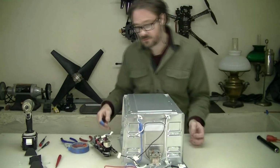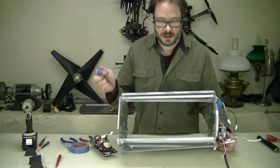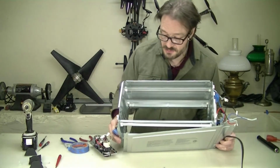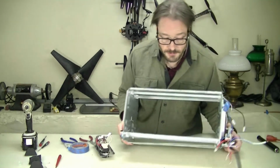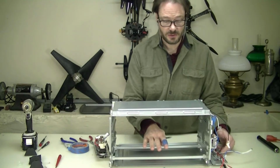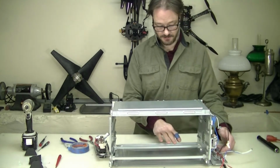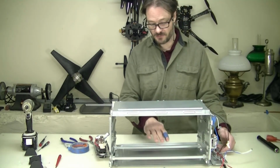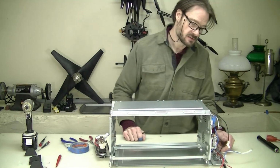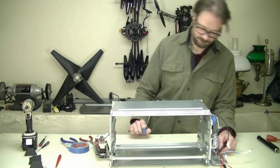And for that reason, I think I'm going to disconnect these top 2 heating elements. Maybe. That's my current thinking. In the bottom there's a drip tray which will provide some direct shielding for radiated infrared from the bottom elements, but there isn't anything provided for the top. So I'm afraid of melting spools. That would be bad.